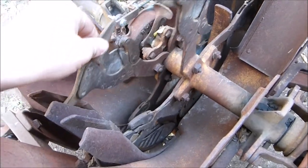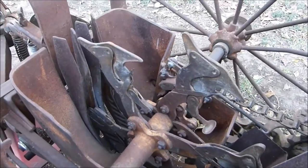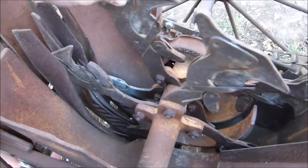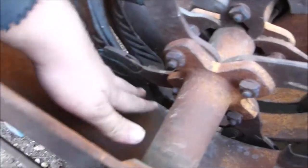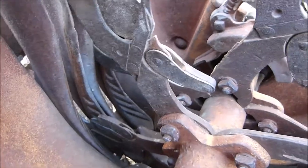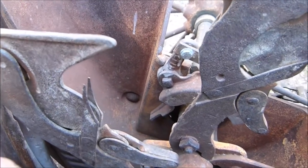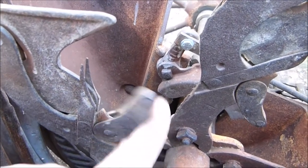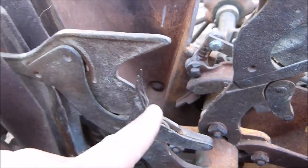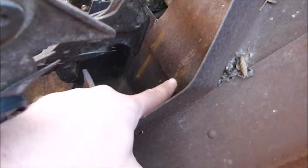So that as this spins around, it picks up the potatoes at the bottom here. These are spring loaded, and it helps push the potatoes onto these finger needles here. As it then continues further around, this flips back to keep more than one potato from getting onto the needles at a time. The needles continue on around, and you'll see they hit this plate over here.